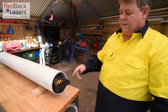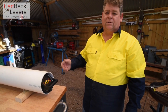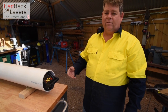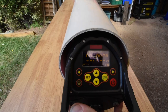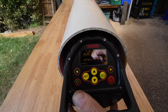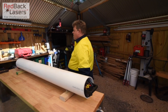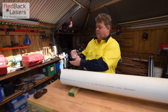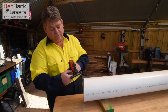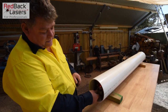Its last setting was set at zero. The pipe laser will go back to its last setting before it was powered off — so if you're running sewer at a 1.67% angle and you power it off, it's going to be at 1.67% when you start it up again. If we look at the back of the laser there's a spirit vial, and we just need to adjust the laser left or right to get that electronic spirit vial showing level. I've got that level now.